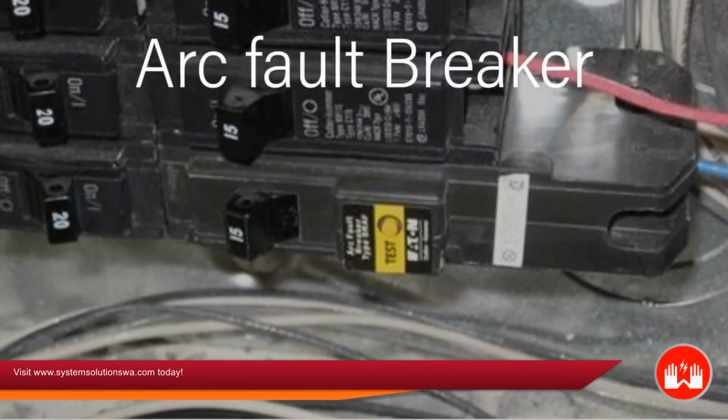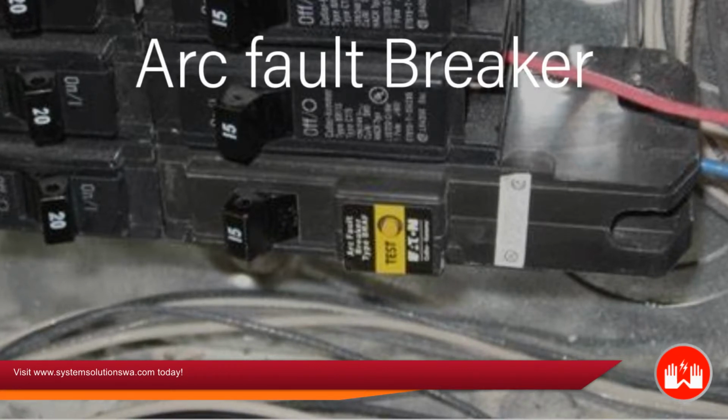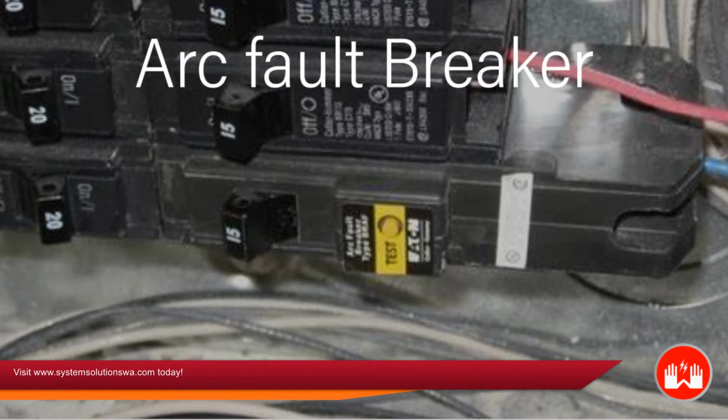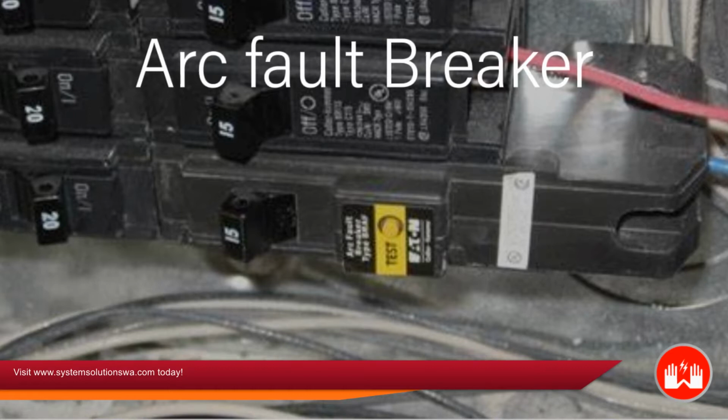Tripped arc fault breakers. Arc fault breakers are one of the latest safety protections to stop electrical fires. Their location is in the electrical panel, unlike a thermal breaker. The arc fault breaker will trip when electrical arcs are detected within the circuit. Electrical arcs are challenging to see. They do not overload the circuit and typically happen out of sight inside electrical outlets, electrical panels, or where wire corrosion happens. These arcs will cause damage to the electrical system and may start fires in your home.